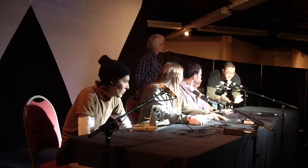Fingers, it's licking and sticking. It's actually one of the more common ways to find a circuit bend. When you have it open and you're playing, you do a little licking and sticking. Wherever you touch one spot and another, and ooh, there's your sound. So you solder your stuff up to it, and you put it to a switch or a light-dependent resistor, and you've got a new sound.